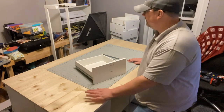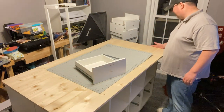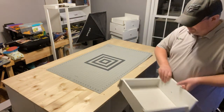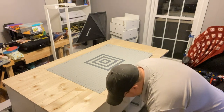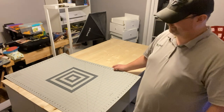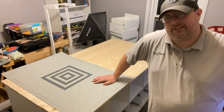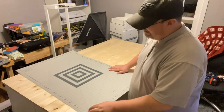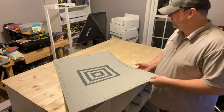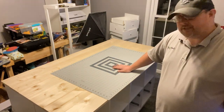I'm going to do a dark oak stain, even out all the edges, and smooth out some high spots with a belt sander. It's the perfect size for my cutting board which is 24 by 36. The tabletop is right at about 32 inches wide by 61 inches long — it fits perfectly over these IKEA Kallax units. It's six one-by-sixes total and it's going to be a really nice work surface once I get the sanding and staining done.